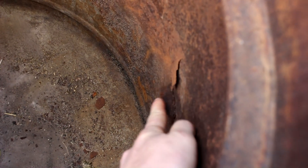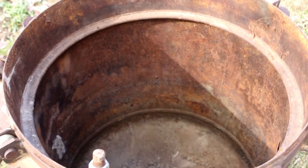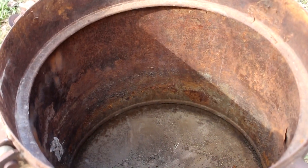You can see there's some rust flaking off here. So I don't think I'm going to go to the full design pressure of 60 psi, even though it probably can handle it. Just to be safe, I don't think I'll ever put more than 30 psi in it. Let's set this thing up so that it can handle a vacuum.